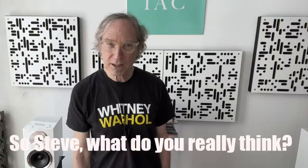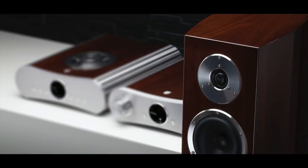I think there's a lot to love about the Gato Audio FM8 stand mount speaker. It's beautiful, beautifully made — you feel the quality coming off this speaker. The sound quality is beautiful, luscious, rich, round — just gorgeous. Now it does need power: give it at least 100 watts from an amplifier capable of 100 watts into 4 ohms; more is nice too. You can't put this speaker near a wall — not just because of the rear port, but it makes enough bass and mid-bass that it'll get boomy close to a wall. A minimum of 18 inches away from the wall is a good starting point. Give it room to breathe and it will open up — the soundstage is big and spacious, very nicely done.